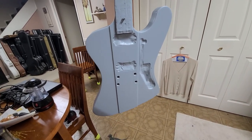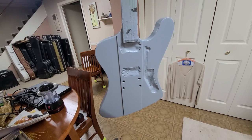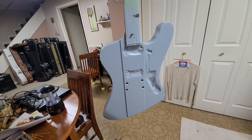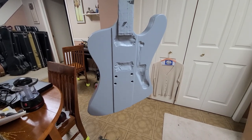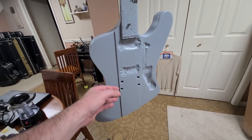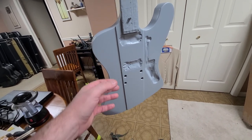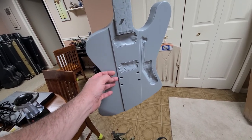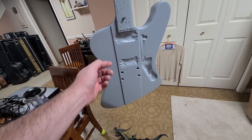So the nice thing about a filler primer is it's thicker. It's kind of like putting a thin glaze coat, and when I say glaze coat, some people refer to it as Bondo as well. It's like putting a thin coat of glaze on the surface of whatever you're working on. So when you transition from paint to bare wood, or in this case veneer, to paint again, that can create a wave. And what happens is you're supposed to feather sand it, which means that the transition from the bare wood to the paint, you get this real wide fade out, when you feather it in.